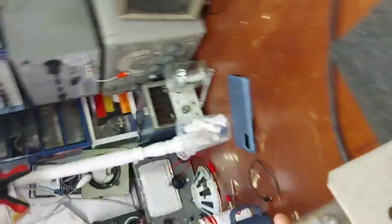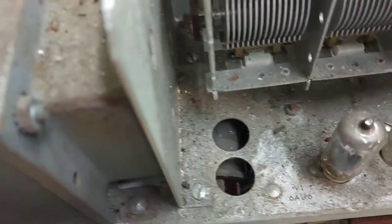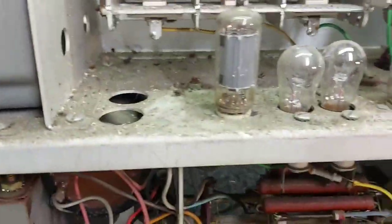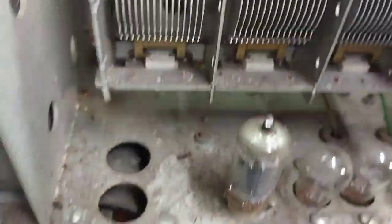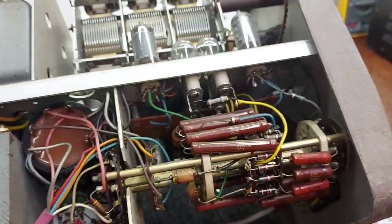There are various little oiling points on the shafts and gearboxes — there are little oil holes here. We'll lubricate all that up. It's a beautiful variable capacitor, and it's filthy, so we'll give it a good clean as well. I have to try and loosen that board off so I can get to the back — there are three or four nuts and bolts to hold the board on. So I'm going to go ahead and do that and we'll see how I'm getting on.